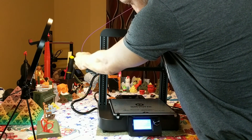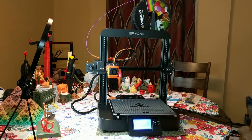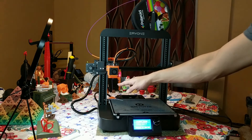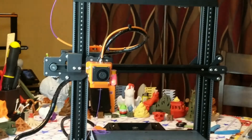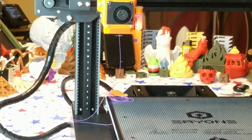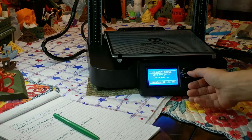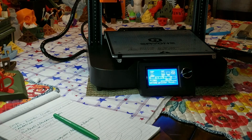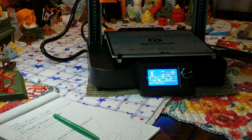The nozzle is heating up and I can push the filament through. That looks good — no clog for sure because it's coming out nicely. Filament inserted, waiting for the purge to happen. This is how the change filament prompt works. There is absolutely no clog — the filament is coming out real straight and nice. That's how you can tell your nozzle isn't clogged: the filament just drops in a straight line and spirals at the bottom. Purge is done — I'm going to say continue and start the test print again.